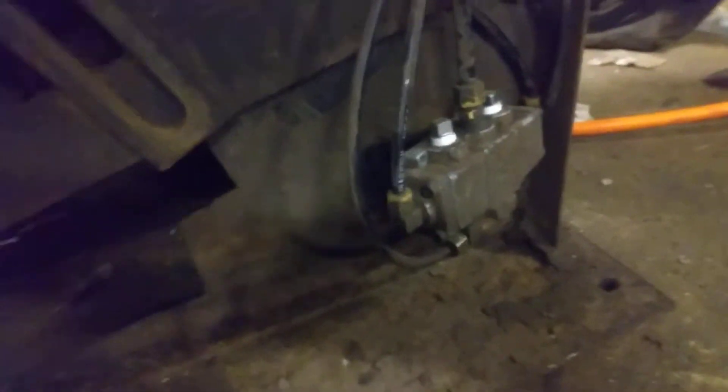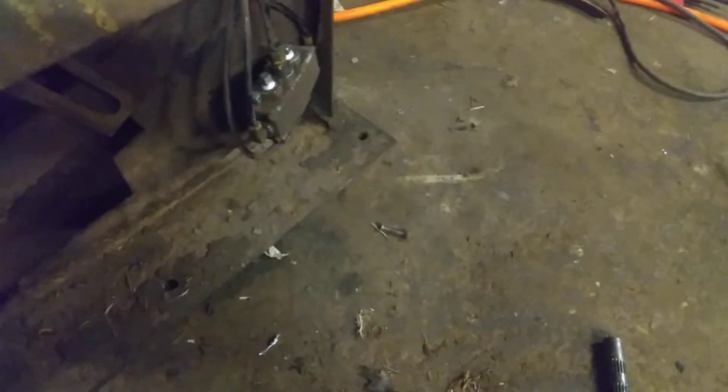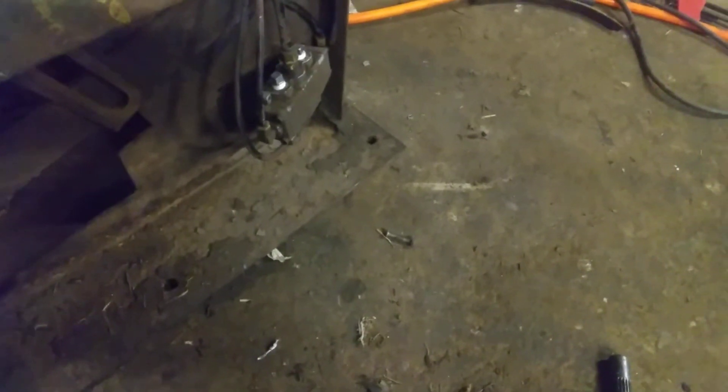This little thing down here — what I did with it was I put two fittings over it and took the little cylinder out of it, because this thing didn't work. It was only allowing air pressure to one side, and it wasn't enough to turn this — it needs both of them, and only one was working. So I took this out and put two block-offs or whatever you call them, and that worked great.